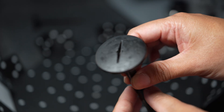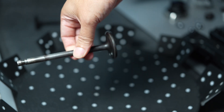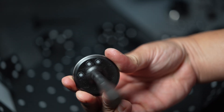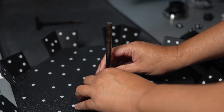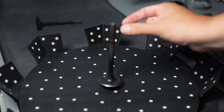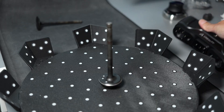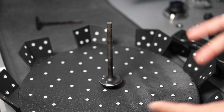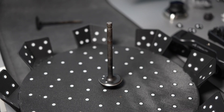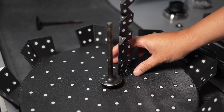Next I'm going to make a 3D scan of the intake valve. I've put three markers because I'm going to make three scans — one, two, and three. These markers are to identify the alignment when I combine the three scans together. I'll place the valve in this orientation to scan the valve seating angle and the valve stem in 360 degrees. This is a high-precision part — I'm going to use the X1. I've already scanned it with the S1 and I'll compare the results. I'm going to scan with the parallel line and place the markers closer to the valve stem for the highest accuracy.